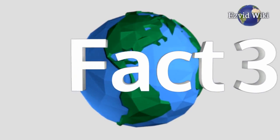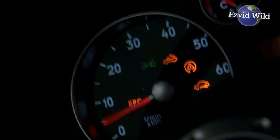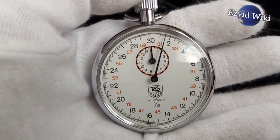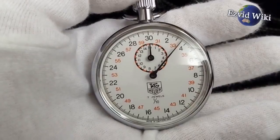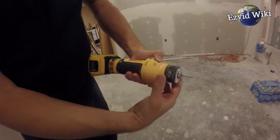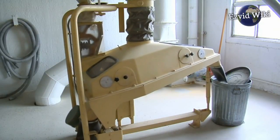Fact number 3. These tools work via thousands of minute side-to-side movements in fast repetition, somewhere in the range of 20,000 strokes per minute. These side-to-side movements are only about 3 degrees, which makes them very easy to control. In the hand it feels as if it has a vibrating motion and has almost no potential for kickback.